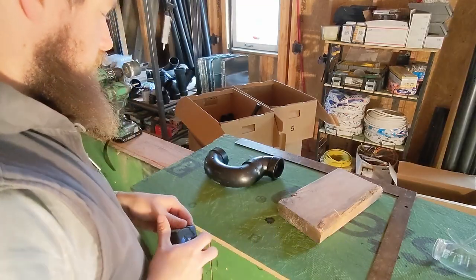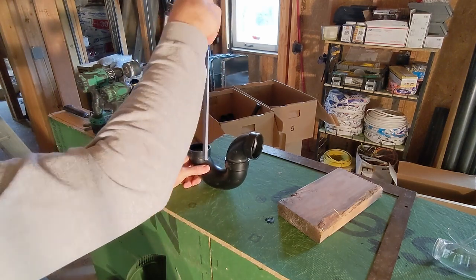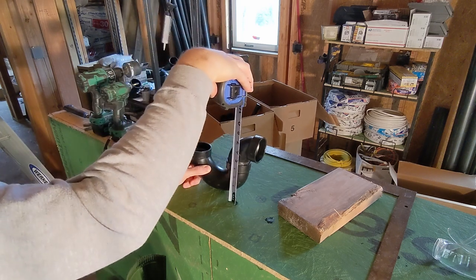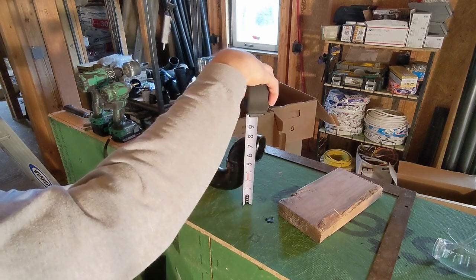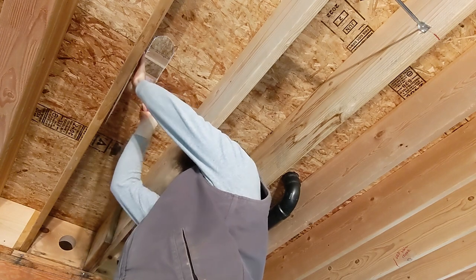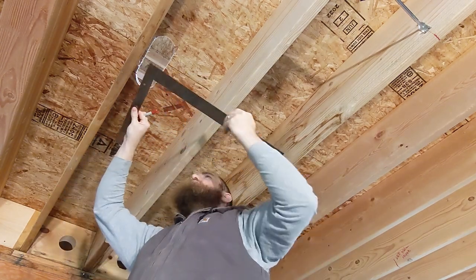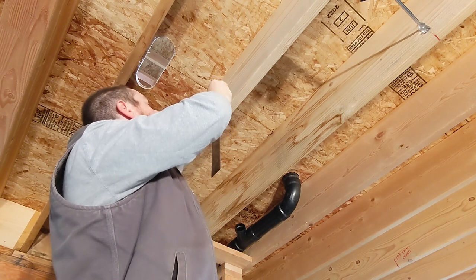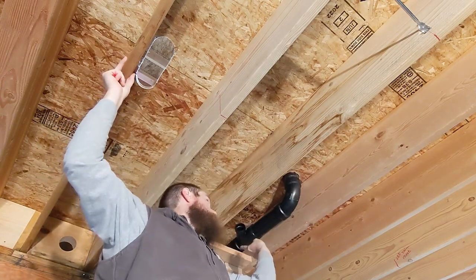And that's going to go towards the house. So here's our little trick: if you don't have dimensions for this guy, these two are the same — it's a U. If we get this guy and he's about four inches, we go over here — that one says four and a half. Bring this guy until he's at four and a quarter. Split the difference, see if it's the same — yep, four and a quarter. And then we line up this center divot right here — that's the halfway point on this pipe — and we got six inches. So I'm just going to run this down, and then it's going to take it across. We are at 11 and a quarter plus, so we're going to go up to five and a quarter plus. That's where we need to be drilling our hole to get this perpendicular cut over, and it will turn once we're into this channel to bring it down.